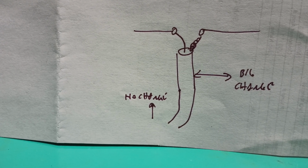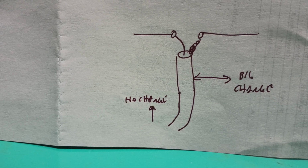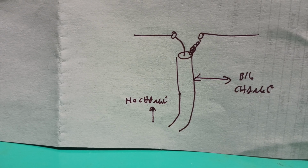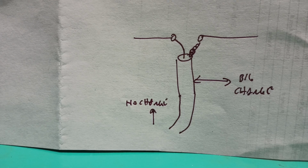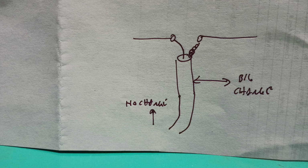The charges between the center conductor and the shield, for the fields inside the wire, are coupled between the inner surface of the shield and the outer surface of the center wire. That's just for the charges. Current doesn't care. Current will go all the way around the wire if it travels.